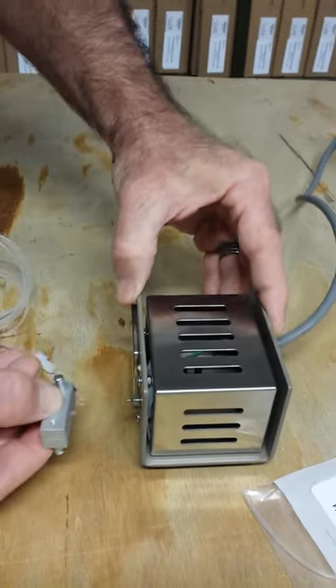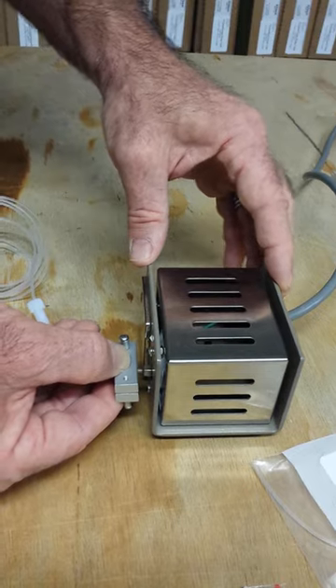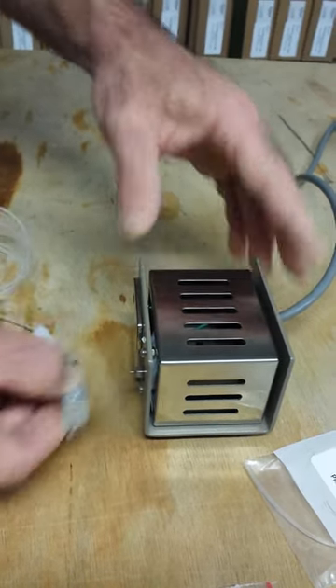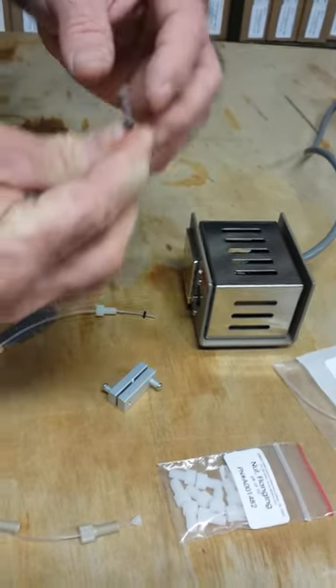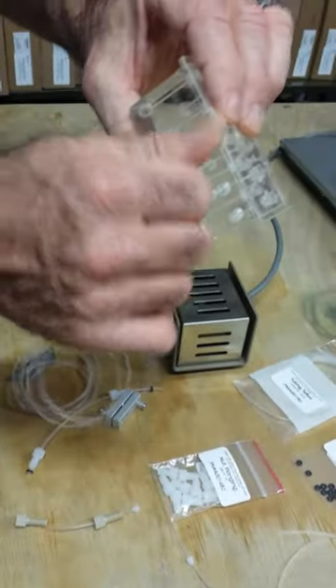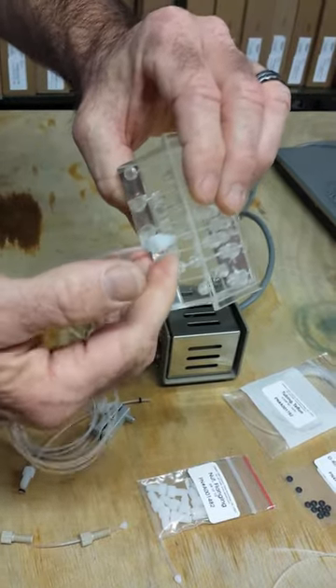You make sure it's straight up and down going in, slide it over the hot flanging device — one-two-three-four-five, one-two-three-four-five — then pull it out. You can see you have a nice flange fitting there, which will easily compress with slight pressure because of the elasticity of the o-ring and create a tight fit.